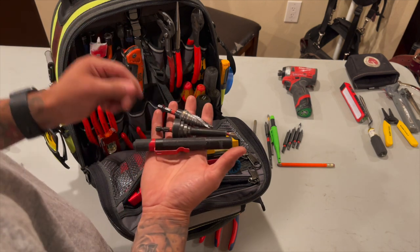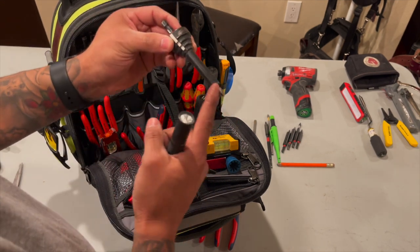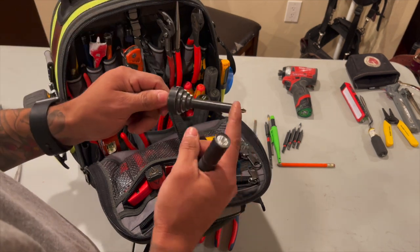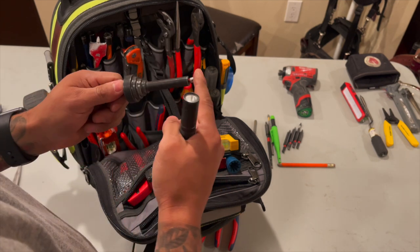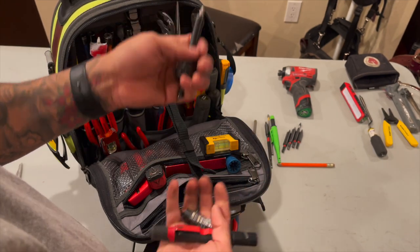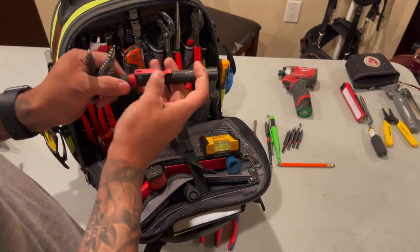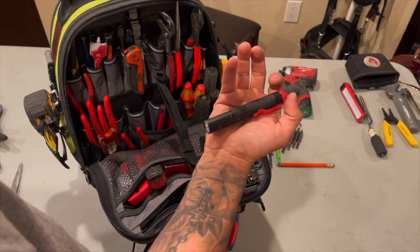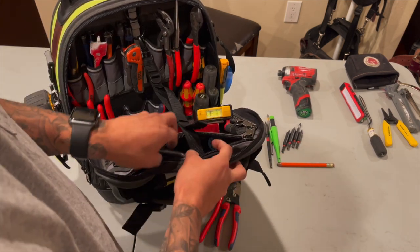Also by Milwaukee - if it's on apex it's probably Milwaukee. For example this reamer by Milwaukee, and it also has a bit. If I'm doing conduit I'm for sure throwing this on my bags, put it on my apex with a Phillips - that way I just ream the conduit and when I put the connector it already has a Phillips. It's a pretty good reamer, it doesn't overdo it. Also for the impact it's awesome just in case you need to knock out your boxes. This penlight by Milwaukee - pretty bright, put it for those tight spaces. I always carry this one as well.